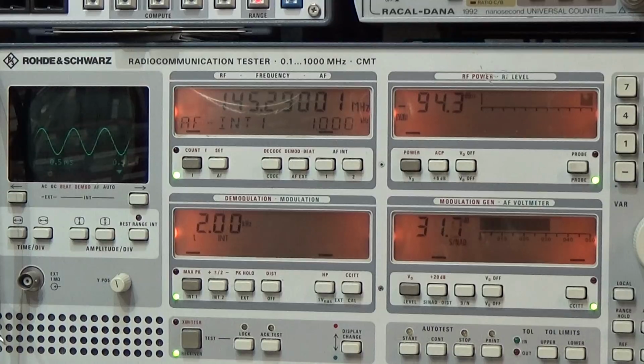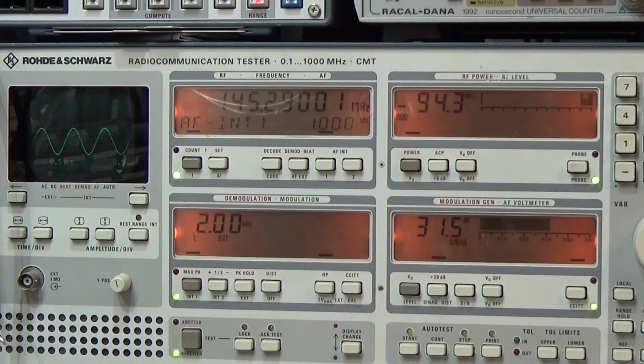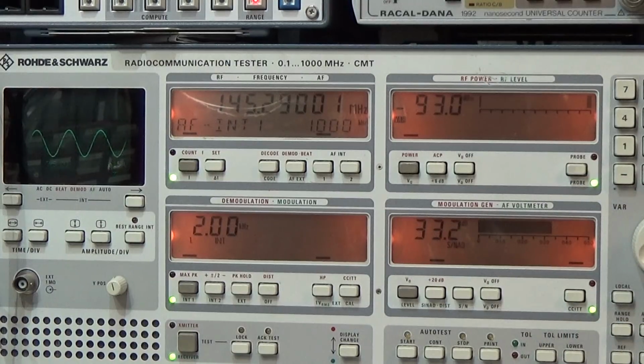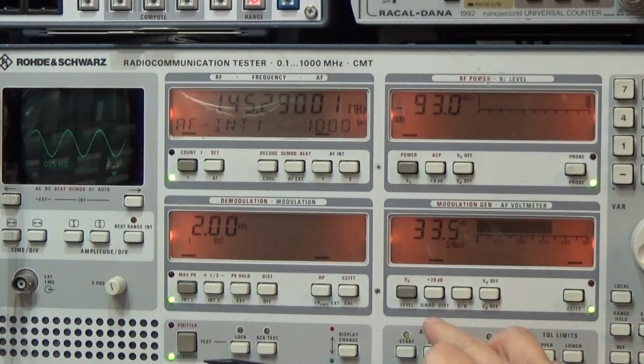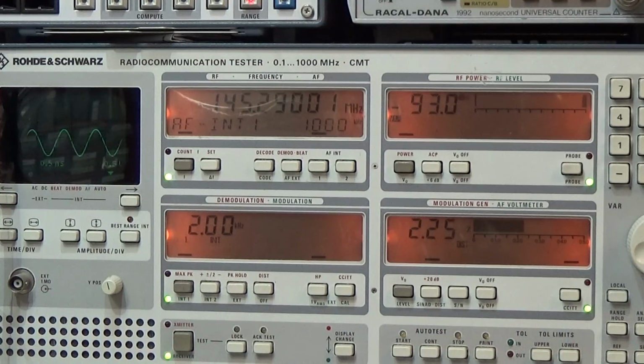And you may remember we are talking here not about shortwave, because with shortwave minus 73 dBm would be S9, and with 2 meter and 70 centimeter we have different parameters, and with minus 93 we have an S9 level. So that is what has been agreed, and therefore you see this is an S9 level, and we have a very, very nice SINAD, and you see our distortion level is quite low, so everything is nice, but we do not have an indication on our S-meter, right?